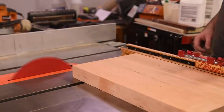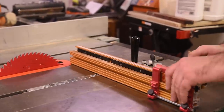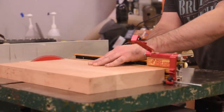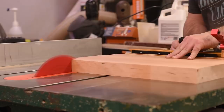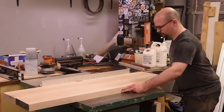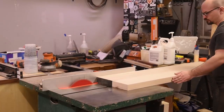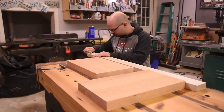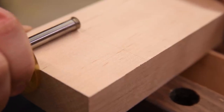Before I can lay out my joinery, I needed to get the top and legs cut to final dimension because I'm going to be measuring from the edges. To get the legs cut to identical lengths, I made sure my miter gauge was square to my table saw blade, cut one end on each piece, then set my stop on my gauge and cut both pieces to length. The bench top was a little wide and needed to be cut down. For aesthetics, I wanted the glue line to stay in the middle of the piece, so instead of bringing it down to dimension with one cut, I made two cuts removing equal amounts from each side. The first joinery I laid out was the tenon on the end of the stretcher, using a marking gauge to get really accurate lines.